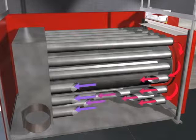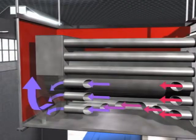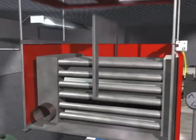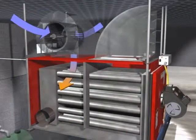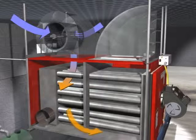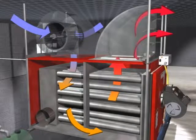Because the hot gases have had such a long travel through the heat exchanger, more heat has been transferred to the heat exchanger itself. The gases finally exit through the stack significantly cooler. The blower introduces cold air in from the top and around the heat exchanger's heated tubes and towards the bottom, picking up heat along its travel. The airflow is then routed back up and out through the louvers. Because the air has had ample time to absorb maximum heat, you realize considerable heating efficiency.